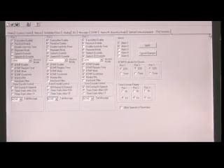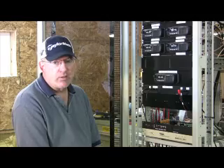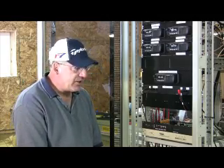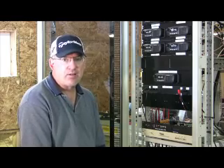Now this is the software for the controller. I'm going to show you the software for the radios. This is the software for the individual radios. It allows you to select channel information, frequencies, bandwidth. There's also radio tuning software, which is a separate program. Utilizing programs like LogMeIn will allow us to have a computer with the controller to allow us to make changes on the fly to messages and so forth on the repeater, which we could never do before. So this will be a lot easier — all Windows-based software, accessible from a mobile device or from the person maintaining the equipment. It saves us a lot of trips out to the site and makes our life a little easier having more modern equipment.